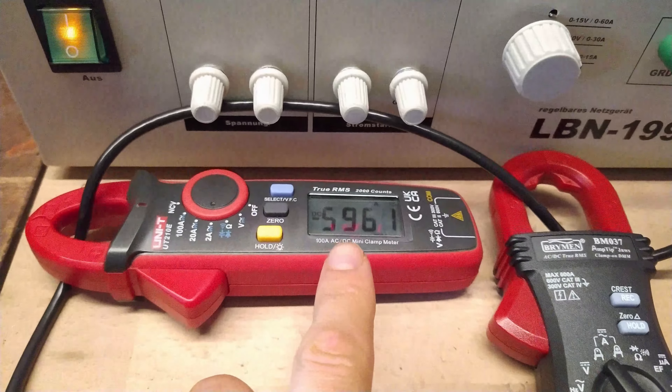If I range up, you're kind of spot-on. So you have to be mindful of that — when you have a very noisy current source with some frequencies on it, you might run into issues when you measure more than 6 amps.